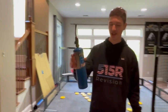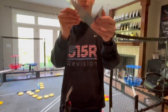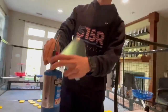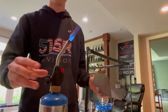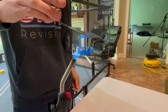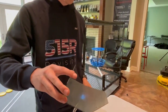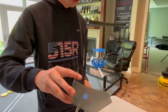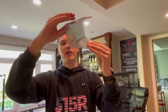Next up, for bending polycarbonate, just having a propane torch is very nice. It's a lot better than a heat gun because not only is it hotter, but you also have a finer point so you can make sharper bends. You'll want to be careful with this because it is a live flame. Turn it on — if we take the polycarbonate and I heat the section right there, now it bends and we have a sharp corner. So it's very quick, very nice for making custom parts.